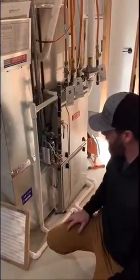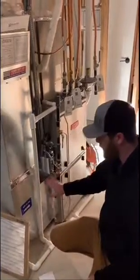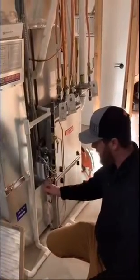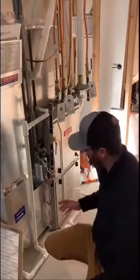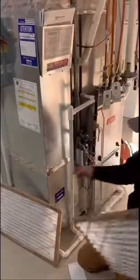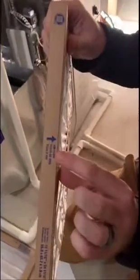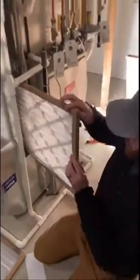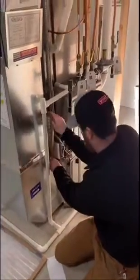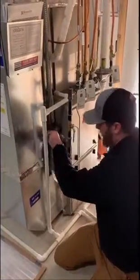We've got a switch installed so you can turn off the airflow. We're going to have a magnetic strip. Some units do come with a panel on the front — you can unscrew it and the filter comes out this way. Pull out the filter. You do want to make sure that you pay attention to the airflow direction on the filter and you're putting it in the correct direction. Put the magnetic strip back.